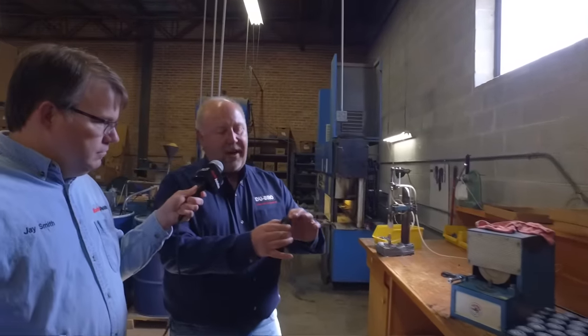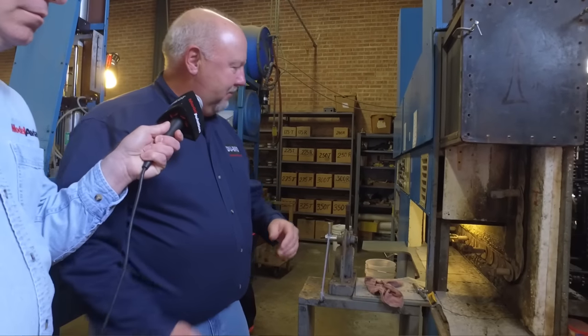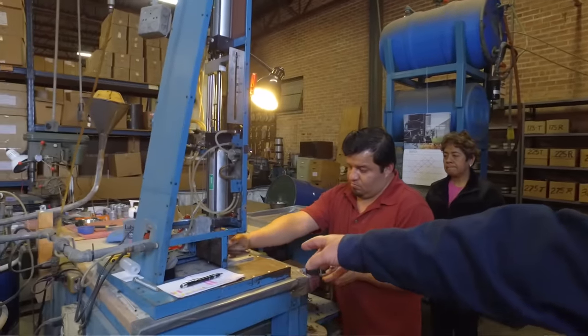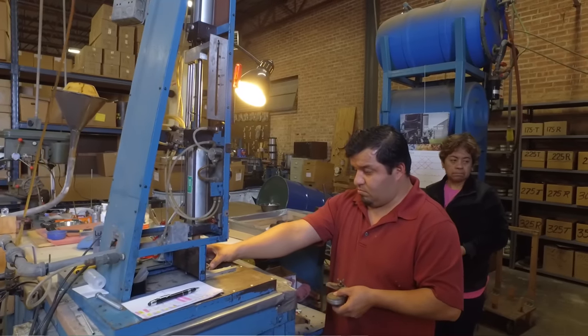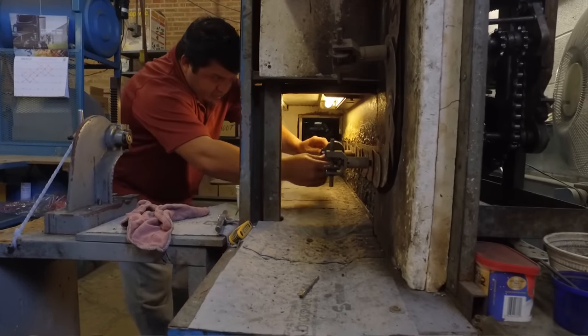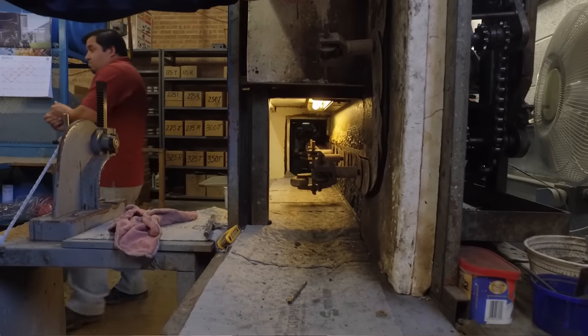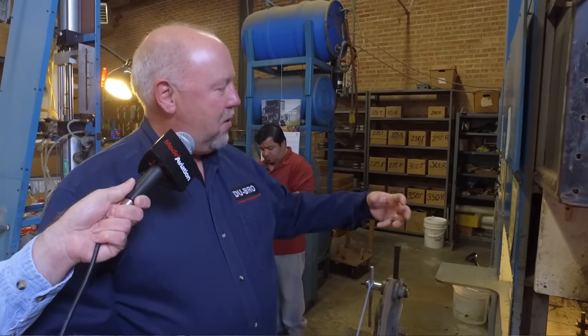The tires we're talking about have air filled in them — kind of like when you're a kid and you play with creepy crawlers, it's very similar to that. This equipment didn't exist — we had to build it. Here's our filling station: he filled the mold halfway with the material. This is a double-head unit, so he's going to make two tires on each head that's in the machine. When he loads the tires on, the gears are in neutral. As we get up in here, the molds are going to start spinning this way and that way, go up through this oven which is at about 700 degrees. It takes about 20 minutes to go continuously around. When it comes out on this end, it goes through a water chamber to cool the molds. When they come out, they're cool to the touch — we pop them out of the mold, put the hubs in them, and we're all set.